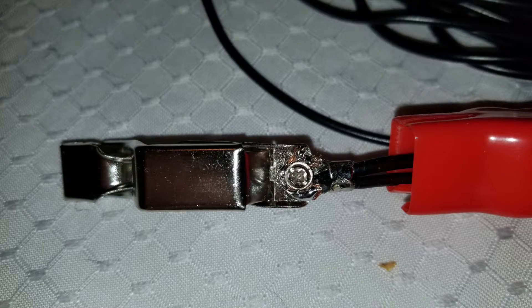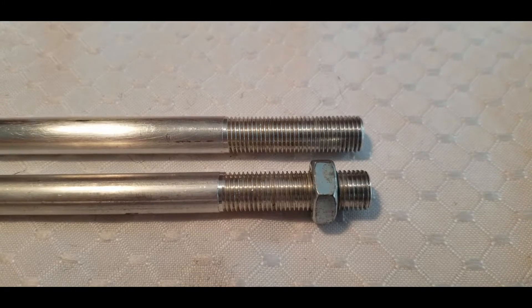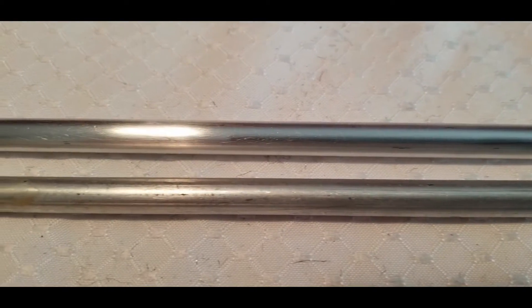I made some new radials using bigger, heavier-duty alligator clips with mechanical crimping and a screw terminal, and I also soldered them to make sure I have a decent connection. You can buy those alligator clips at Lowe's, Home Depot, or Amazon. They happened to be red, which fit my new red color scheme. I made the radials 33 feet long — same as the originals — but I doubled them up, so I have three radials with two each, giving me 66 feet total.